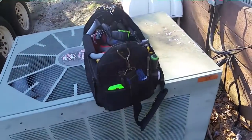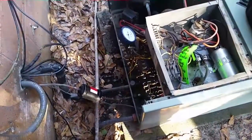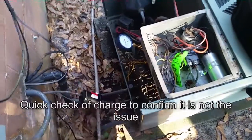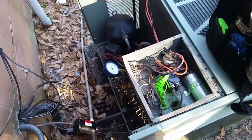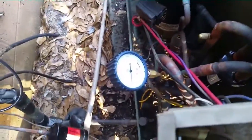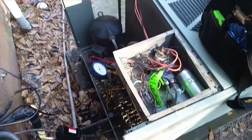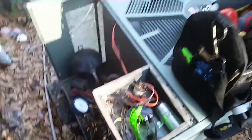The dryer vent is still spilling stuff onto the unit. Using a non-scientific method, I checked the temperature on this line here - it's not beer-can cold, it's nice and hot. The pressure goes down and starts to come back up again. As long as we come back up in the general neighborhood of 40 to 50 pounds, since we're around 40 degrees outside, I'll be satisfied.